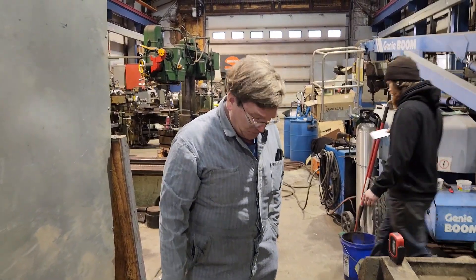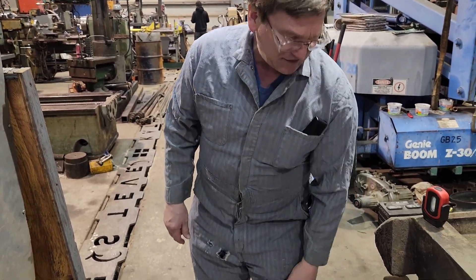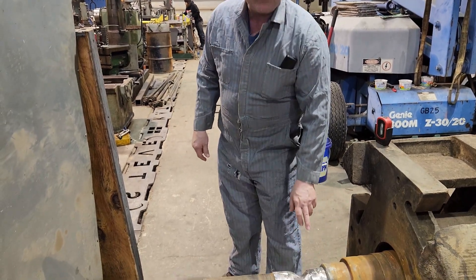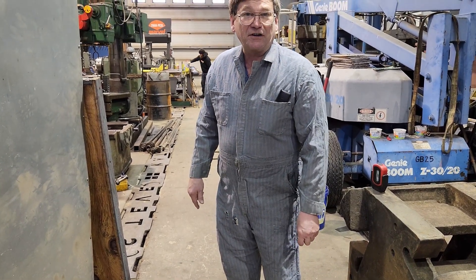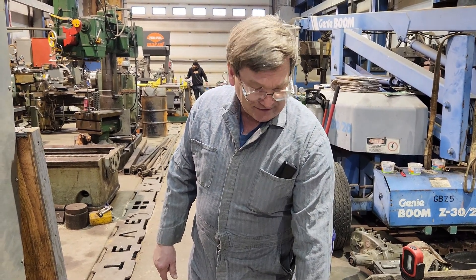When we stand it upright, we will be working with the stick. People ask why don't we use wire feed? From what I've found on a job like this — if everything was consistent, this was machined, and we had a way to turn it, we might save a little time with wire feed. But most of the time you're going along with wire feed, everything's going good, and then something goes wrong and it's back where you start getting a few little bubbles, and it's just too fast.